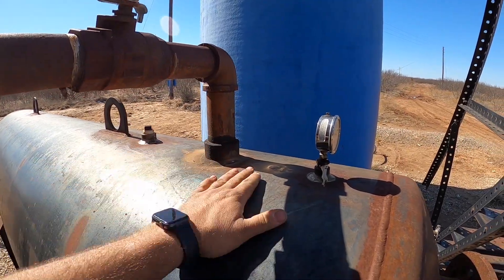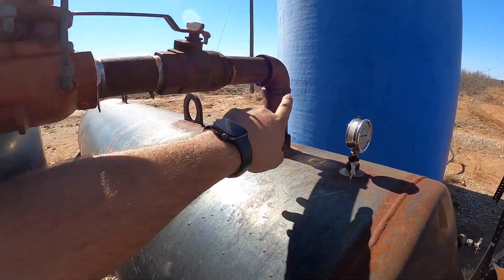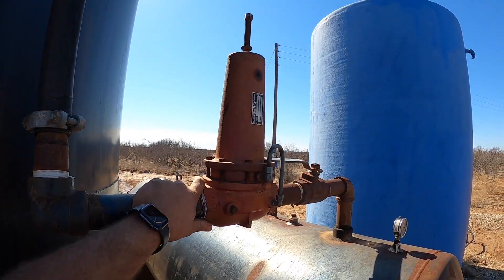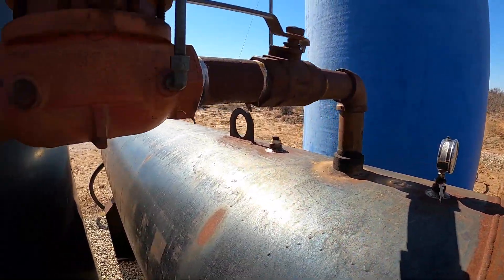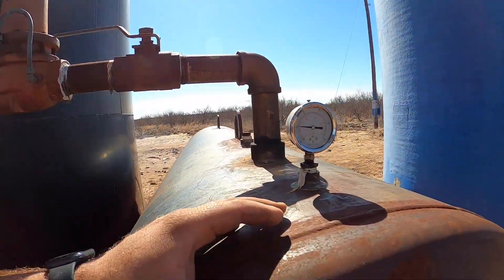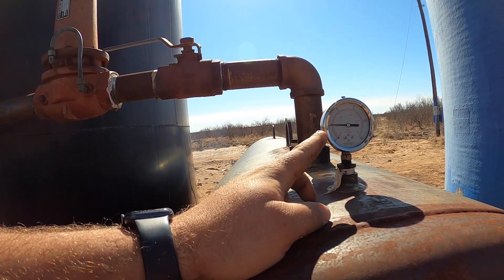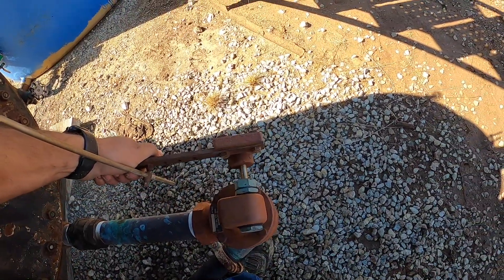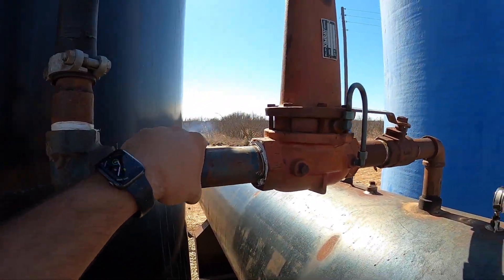Right here is where the oil comes out of the separator — it comes out of the top through a connection welded there, back to a valve, and into the oil dump valve. This oil dump valve is simply a back pressure regulator. It opens and controls the pressure on the back side of the valve, which encompasses the separator, the flow lines, and the wells. We've got a gauge here showing about three and a quarter psi, going up and down. The pressure is relatively low and I can hear stuff going through this valve, which is what initiated me looking at this separator.